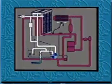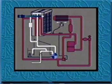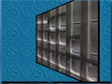When the pump-out cycle is completed, the pump motor stops and the inlet water valve opens. Just as in the initial harvest, the evaporator is warmed by the hot gas defrost and water assist, clearing any ice left frozen on the plate as the reservoir then refills in preparation for the next freeze cycle.